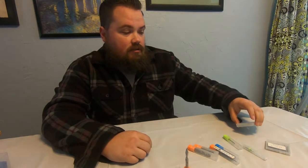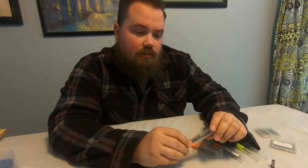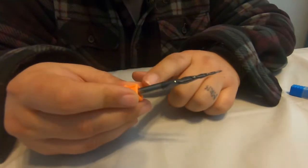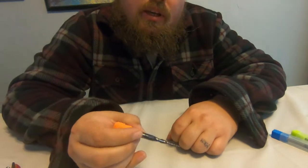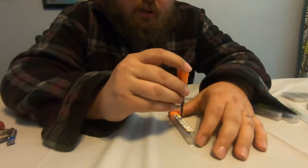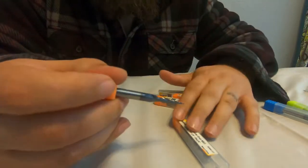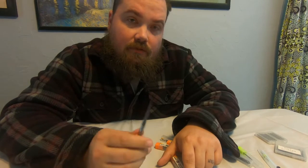Those are the bits we originally bought. Since then we've actually gone up in quality without spending a whole lot of money, and that's what I wanted to talk about today — good budget bits you can buy. This kit came with four carbide-tipped bits. This is a tapered bullnose: it's a quarter inch shank that tapers down to a very fine tip. It works extremely well because it's a very strong bit and can cut very fine detail for 3D cuts. The only problem is if you're coming off a ledge and need fine detail close to it, you can't — you'll cut into your ledge because of the taper. That's when you'd use a non-tapered flat end mill. But if you don't have any ledges, this is going to be your best finish bit for any kind of 3D cutting.